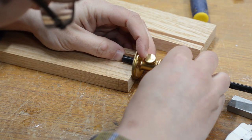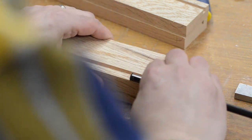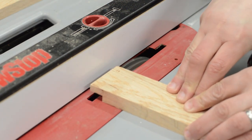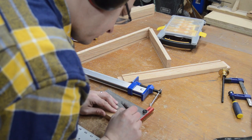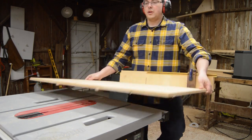Since the sides were a little long, I found the center line and measured 9 inches out from each side. I then set my marking gauge to that line and marked all the sides. This both helped me mark the parts as well as limit tear out as I cut them on the table saw. I used a much wider dado setup to speed through the cutting of these joints. After rough assembly, I took measurements of the ends of the trays. They were wider than I wanted, which means I either cut the rabbet deeper or trimmed the edges shorter.